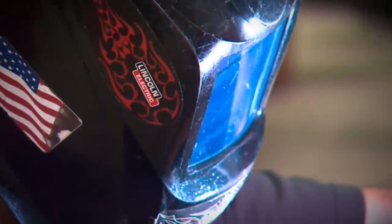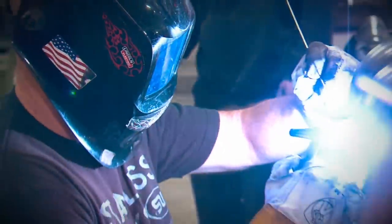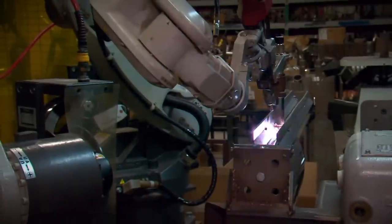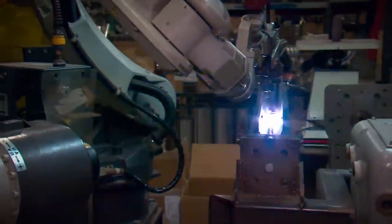If you remember the good old days, you kind of had to make everything fit. As time's progressed, customers expect better and better quality. So we TIG weld everything — for the exhaust business and our commercial side. We have a 6,000-watt laser; we can laser up to one-inch thick steel, three-quarter-inch stainless, three-quarter-inch aluminum. But that technology just keeps everything right where it needs to be. Probably 90% of our headers are still hand TIG welded.